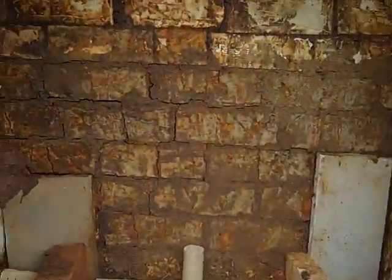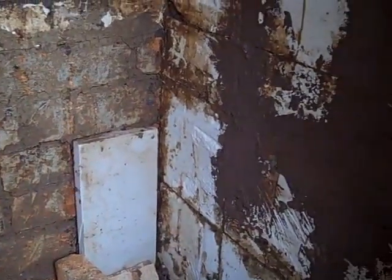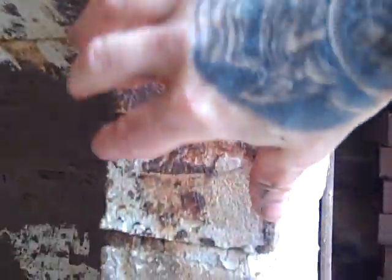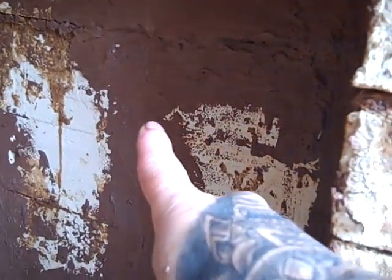Here it is. Okay, I've been doing some running repairs on the kiln. I had an oxidation problem and I've had a look at the kiln today, and I don't know if we can see it properly, but up in here a large crack appeared, about a centimetre wide, all up inside behind the front wall, and some cracks appeared in the brickwork.